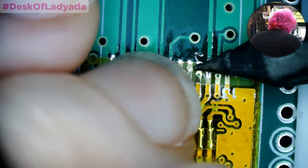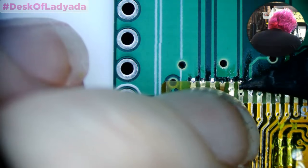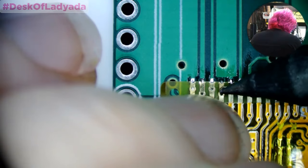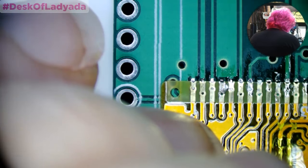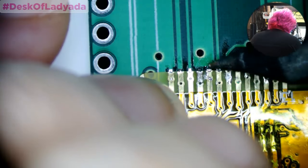Why not use a flux pen to prepare the pads? I could, but I don't need to. I put some solder down and the pads are well-defined, so if you heat them up they flow very nicely. Shouldn't you still clean no-clean flux? No — no-clean means no cleaning. We don't have a link to the microscope we're using now because we don't want people to buy something that's not going to work out — we're still testing a bunch, live, as in you're watching now, because we're crazy.